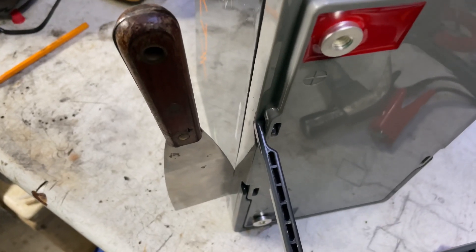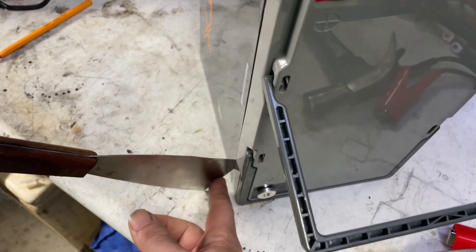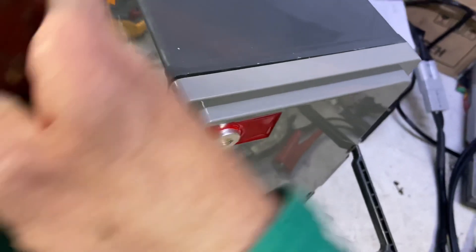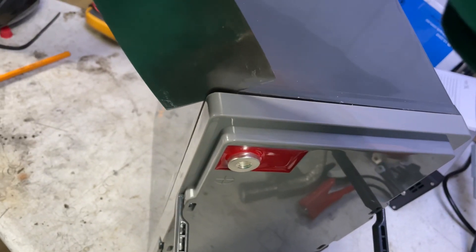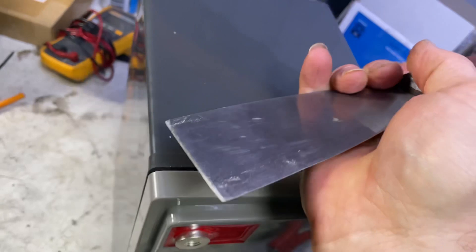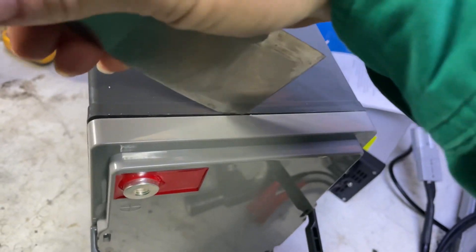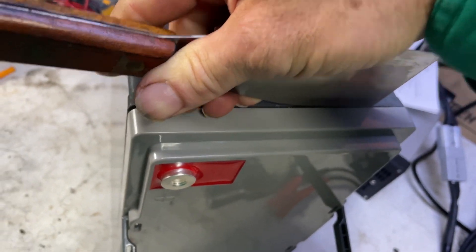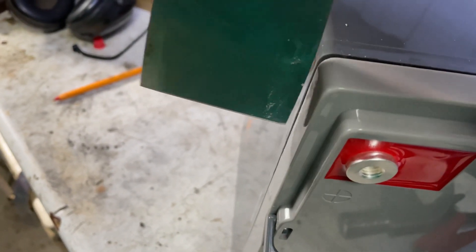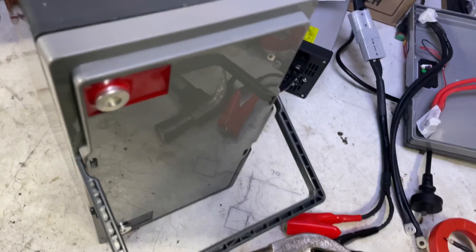Just to show you how I cut the batteries open. Using a paint scraper with the edge sharpened, you start at the corner, put the paint scraper in on an angle with the cutting edge facing towards the top of the battery, cut through and down there, just hitting it with a hammer — trying to keep the edge not too far in so you don't cut everything else — then use a screwdriver to pry it open as you go.